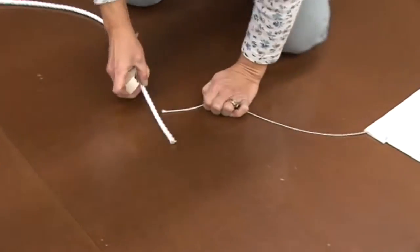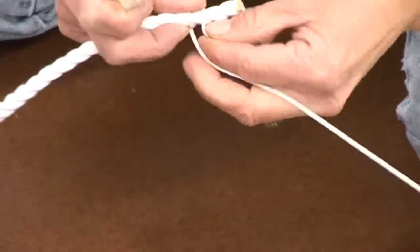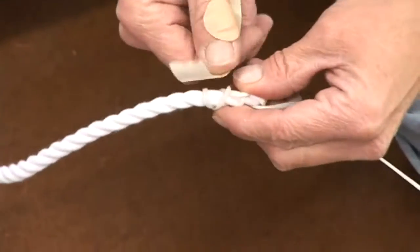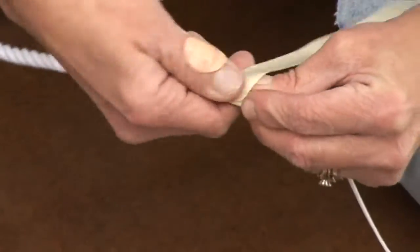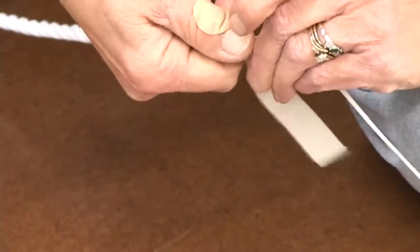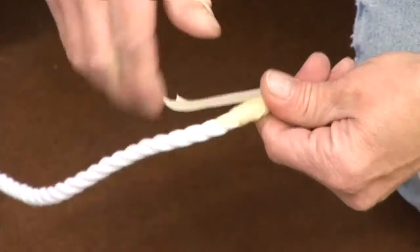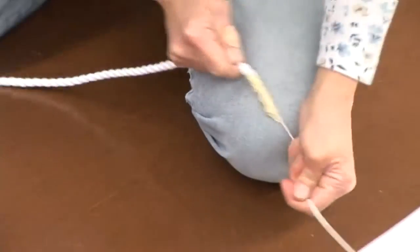We'll now attach the string to the bolt rope that's included in your kit. We'll just use some masking tape to secure it tightly to that rope. It can pull through a little bit hard. For larger boats, it obviously can pull through a lot much harder. This is a 24-foot Seaward, so it's not going to require much to pull this bolt rope through the sleeve.